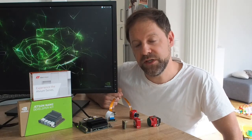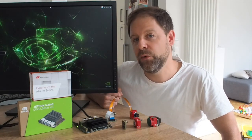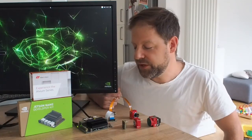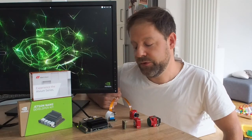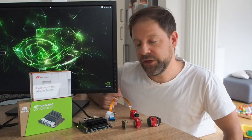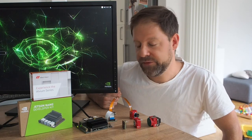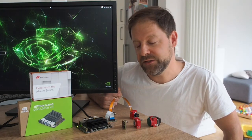CSI 2 was really designed for image transfer, so it's very efficient and low overhead. However, there is one pitfall to CSI 2: there is no standardized driver available. So for every embedded system and for every camera module, you generally need a dedicated driver.